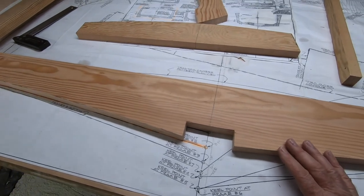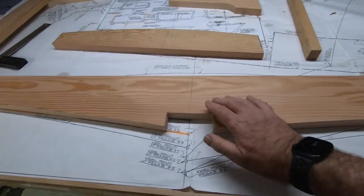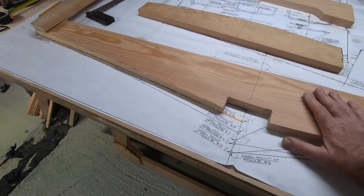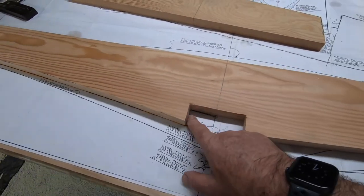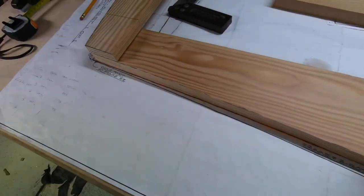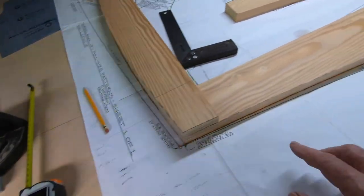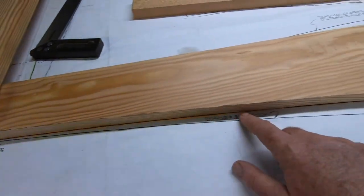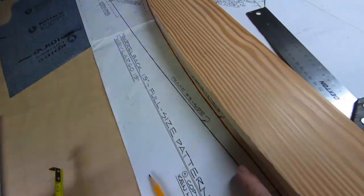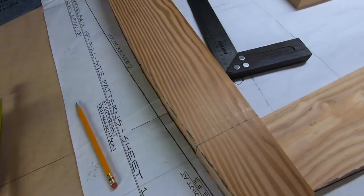I've cut all the pieces out. It's a little bit simpler this one for frame two. This is my bottom piece, which is a solid piece because it's at the bottom of the boat — it's a structural member. This is my cutout for the two keel timbers, this is the side, and this is the top piece. I just pre-assemble them to show that the orange line follows the curve pretty much perfectly all the way to the shear point within a millimetre or so.